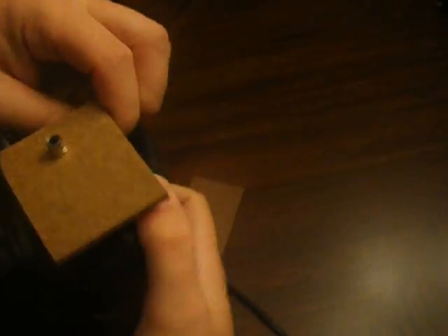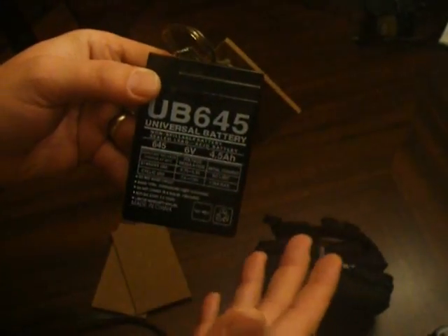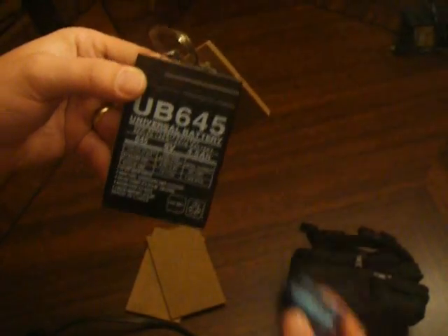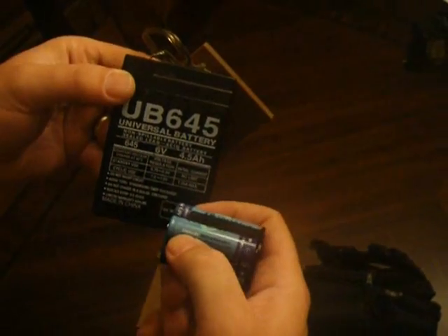To have something to connect to this, I made this power pack — I can't take credit for this, it's from Al Jacobs. But I did my own little thing here. I put a little bit of wood — this is just medium density fiberboard, get it at Home Depot for practically nothing — around this to give it a little structure. This is actually a $3 camera bag from Walmart. This here is a universal battery — it's a sealed lead acid, just like in your car. Extremely heavy duty. 4.5 amp hours — we're talking hours worth of power versus milliamps. These are 2600 milliamps, so side by side they'd be rated 2.6 versus 4.5. But these are actually rated under load where these are not, so these last a lot longer.